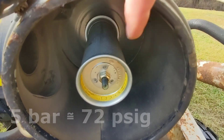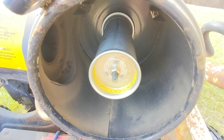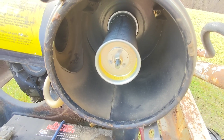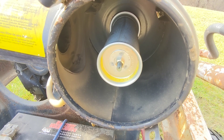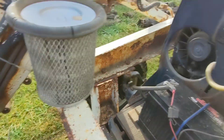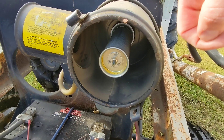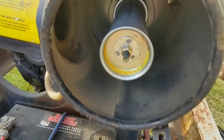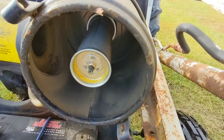This inner cartridge is what's known as the inner filter, or sometimes called the safety filter. It is a felt cartridge and is not serviceable — don't attempt to clean it. For maintenance, replace it every 2000 hours of operation, or if the yellow dash indicator for a dirty air filter comes on and you've already cleaned the outer element and that yellow light still keeps coming on, it's time to replace that inner felt filter. I haven't replaced this one yet on the tractor so far, but it's probably coming up in the next year or so.